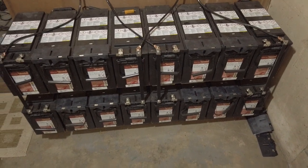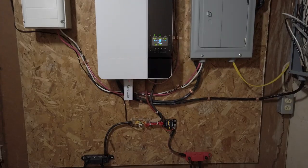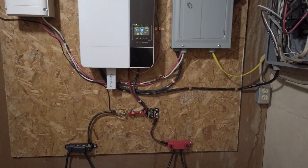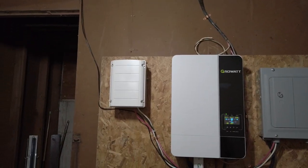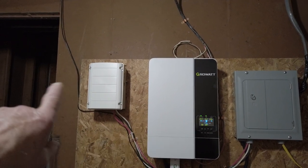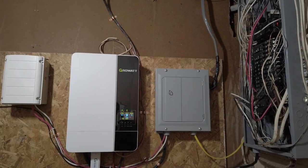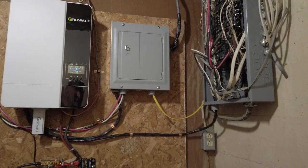I have a 5200-watt solar array outside. It's dark now so it's not going to show the solar input, but it's 375 volts into it. I could put a few more panels up but I don't want to because of fluctuations. I bought this on Signature Solar — $1300 for the inverter and the auto transformer. I have two 120 legs so I can run 110 appliances off of it and also 240.